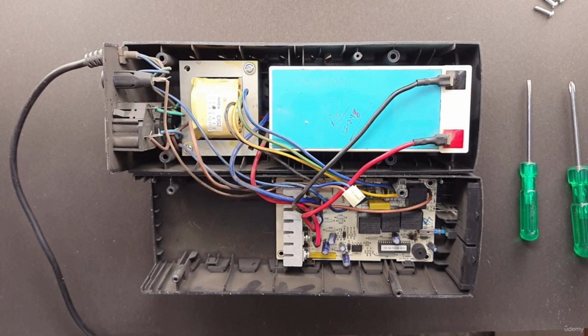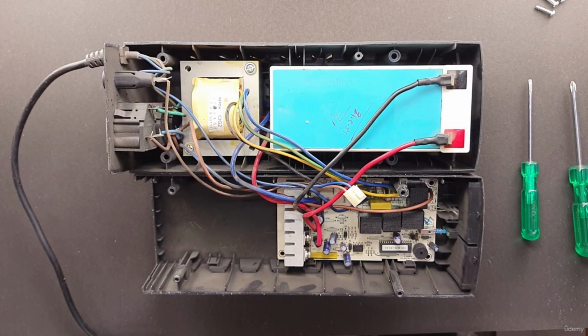The first most common error is replacing a screw with another type of screw. If the screw is too long and it touches the circuit board, it can short a component on the circuit board, or it can touch the chassis and hence the ground and once again short it. Over tightening screws can strip their heads, making it very hard to get them out again. Under tightening screws may lead to them falling out later.